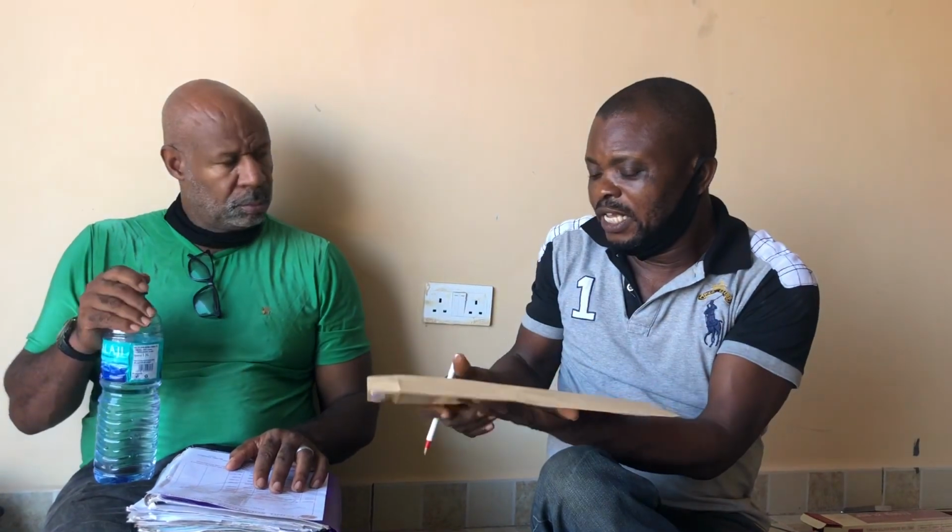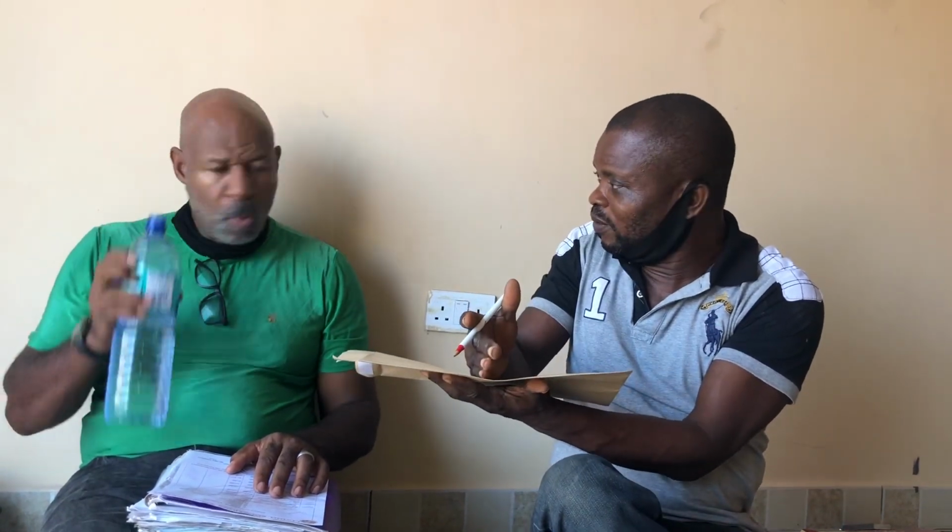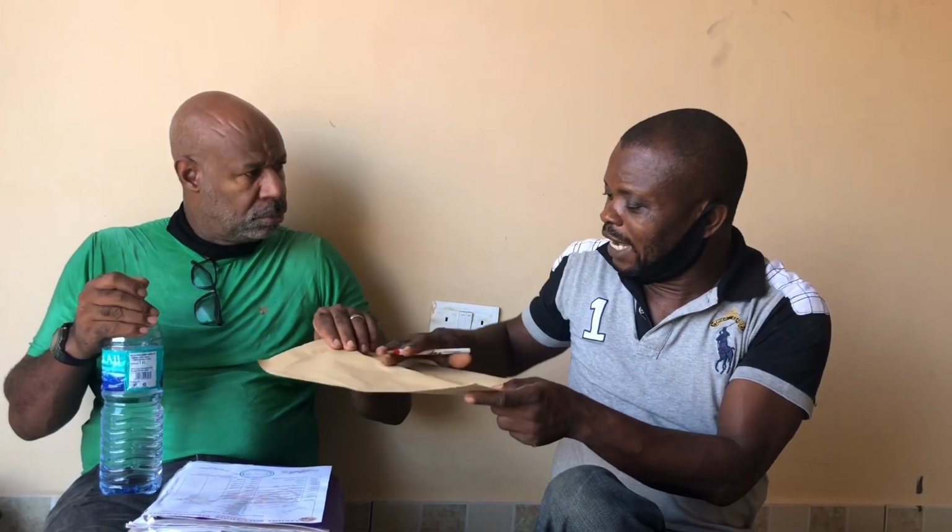The second reason why we do that is, if you cast a foundation right now, it's not strong in 2 days. If you put a load on this side now, it's not solid. Look what it will do. It's going to crack. It might not happen immediately, but it will happen in the future.